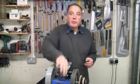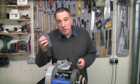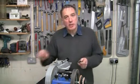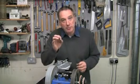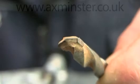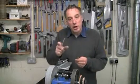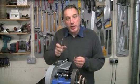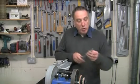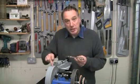If you're sharpening really small bits, it might be worth reducing the coarseness of the stone using the stone grader — knock it back to a thousand grit, which is just a little bit less aggressive for those really small diameter bits. You can, however, use a standard stone for sharpening tungsten carbide bits; these only need one primary facet, so it's very quick and easy to do. However, if they need a lot of serious reshaping, or for very large diameter bits, it might be worth investing in a black stone instead.